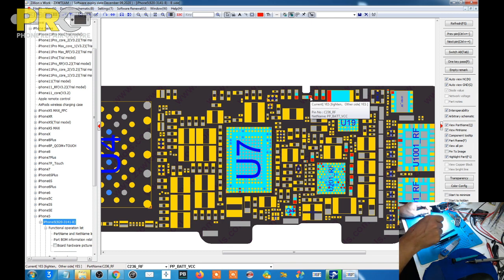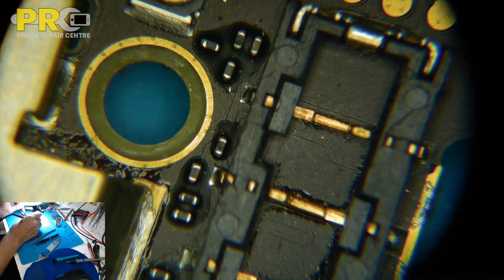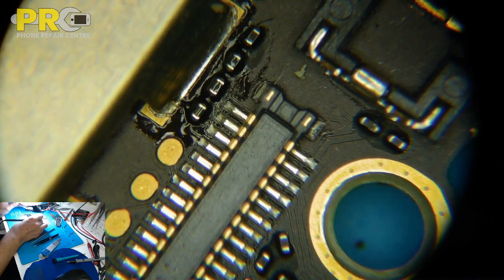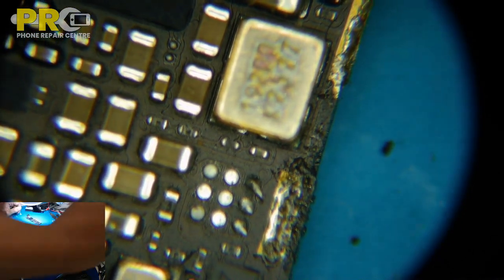Okay, that thing is off. Now we're gonna test it with the multimeter. So now I'm testing with the multimeter, there is no short. Negative to the ground. Positive over here. Diode mode reading is 366, which is very similar to the working board. So all I need to do is, I took this off for no reason. I need to re-jumper this one.